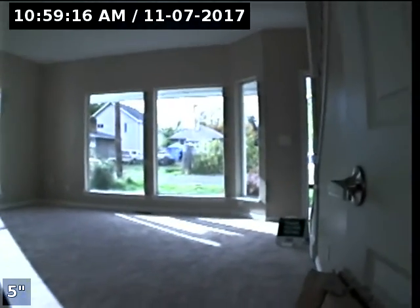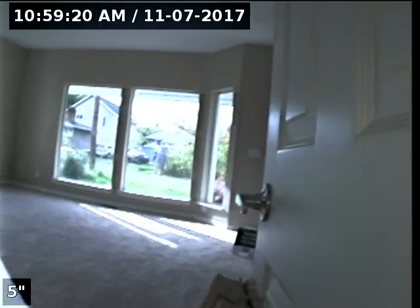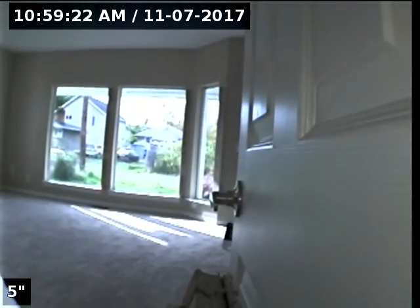I was unable to locate a clean out outside. There is a clean out directly below the crawl space access here inside the home. There's the front door, and as you can see out the window, that's the South Street entry to the property. There is a manhole directly on the property out there next to the electrical pole. That's where I'm assuming that the pipe or the lateral is going to end.